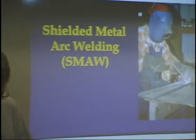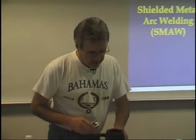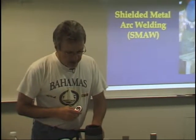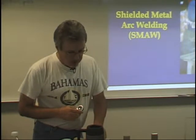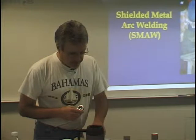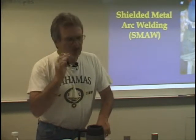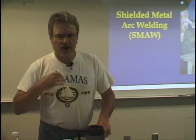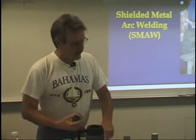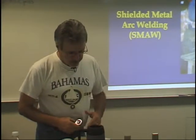Let me read what it says here. It says SMAW is manual arc welding in which the heat of welding is generated by an electric arc established between a flux-covered consumable metal rod called the electrode and the work. For this reason, the process is also called stick electrode welding. That's really not a term that you hear very much, but some people will call it stick welding. The proper term is shielded metal arc welding, so that's the one I'd like you to use.